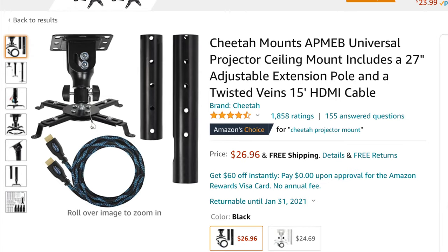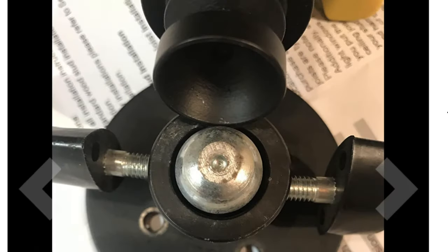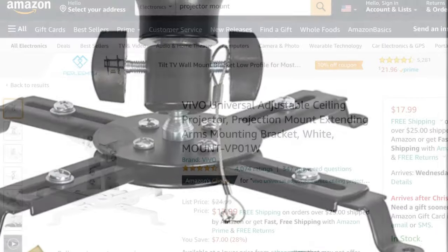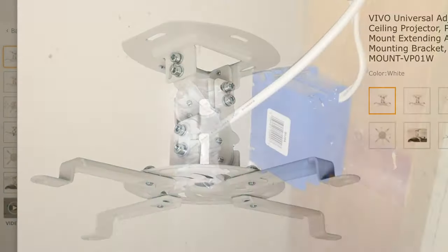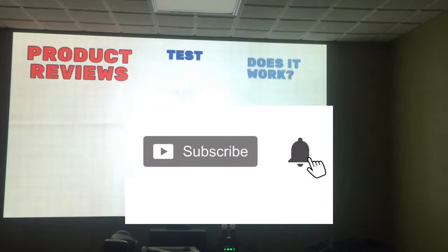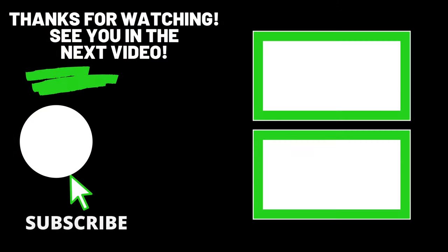That wraps up this portion of the project. The projector is mounted and operating. I don't think I would have done much different — I'm pretty satisfied with how things turned out. The one thing I probably would have done differently is selected a different projector mount. This one has a ball and socket joint, which I think is a weak link. Functionally it seems like a good idea, but structurally I don't care for it, and the fact that it comes with an undersized safety wire speaks to me as well. If I did this again I would get a different one — simple and straightforward with all connections visible. I know this build was pretty unique and yours will be too, but hopefully you could extract some helpful tips out of this. Thanks for watching — if you found it helpful, please give it a like and subscribe so you don't miss the next video.